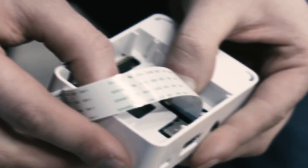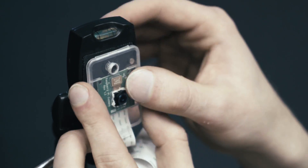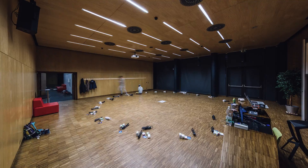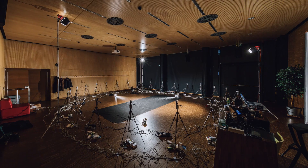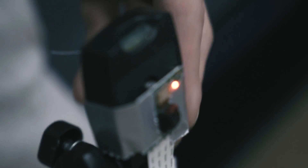We took 24 Raspberry Pi computers and webcams to build a giant 3D scanner, which works similarly to a bullet timer, photographing persons and objects from 24 different angles. We also did a little programming so all of the cameras wouldn't shoot at once, but with a delay of 83 milliseconds.